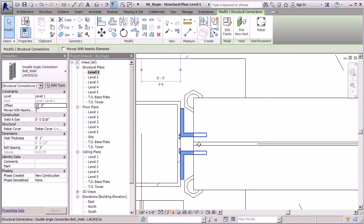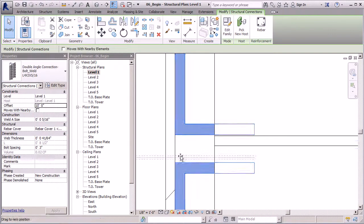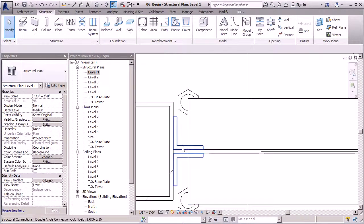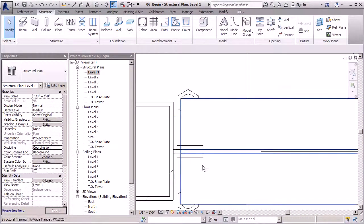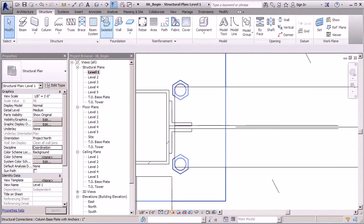The only thing I want to do now is close the gap and get a better grip on this beam. After we close that gap we can adjust our cutback. I'll simply drag this guy down — we know this is going to be a nice tight snug connection. I want to make sure it stops right at the edge of my flange. Now that it's in place, let's adjust our cutback. I'll click on my beam and add a half inch of grip — I'll make that cutback just half an inch less, so instead of an inch we'll convert that to half an inch on both sides. That gives us better grip and I know my bolts will fit. You can always make adjustments according to what the engineer needs or if there are design changes later on.